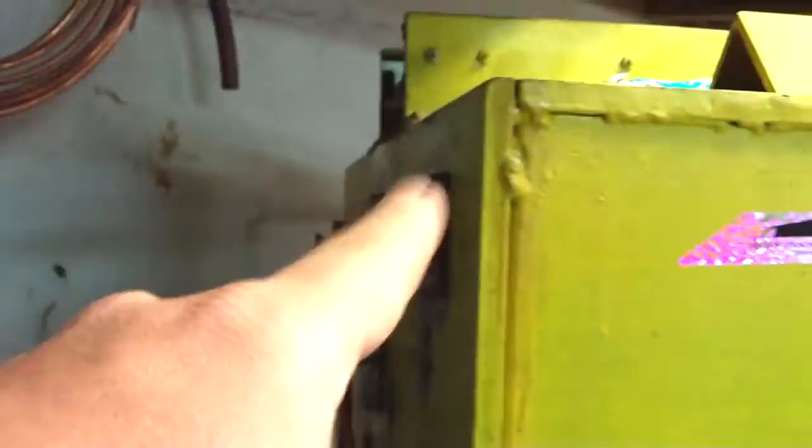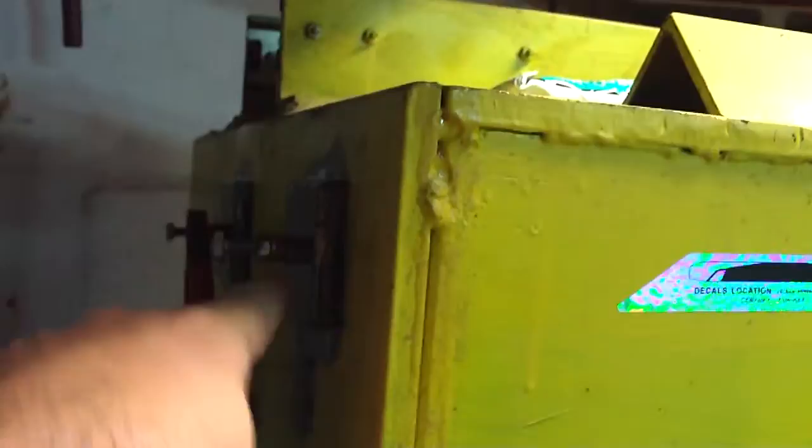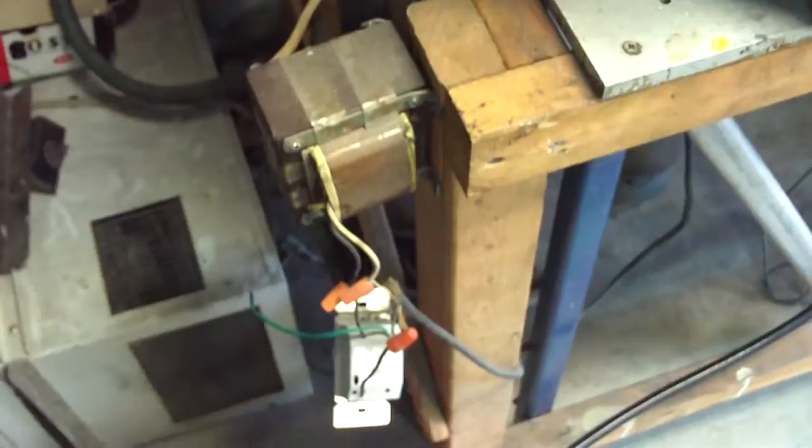In the back I've got these crude electrical passthroughs. I drilled a big hole — about a one-inch hole — glued a piece of glass to it, drilled a hole in the piece of glass, and put a bolt with an O-ring on it. Then I've got a jumper cable that I connect to my big transformer down here on a dimmer switch to control how much power goes through the tungsten and how hot it glows. I found it really just needs to glow really hot.